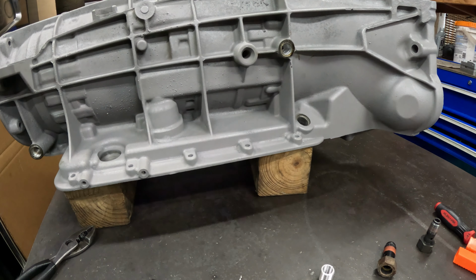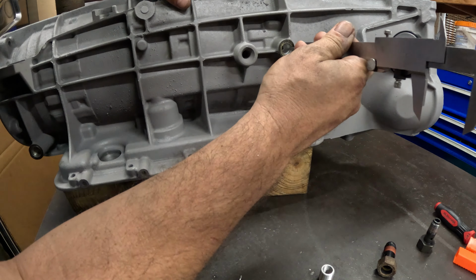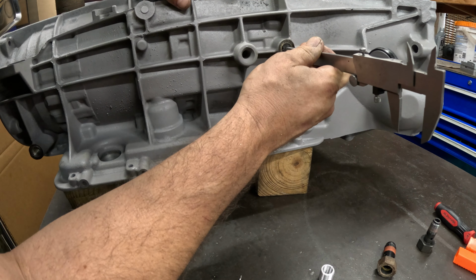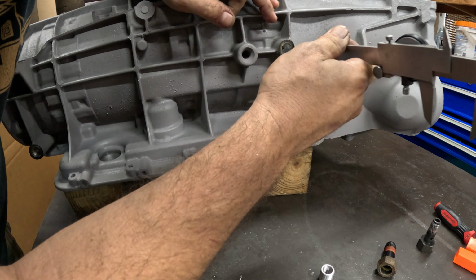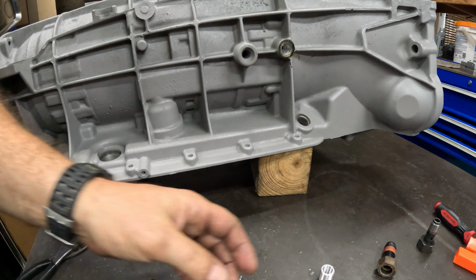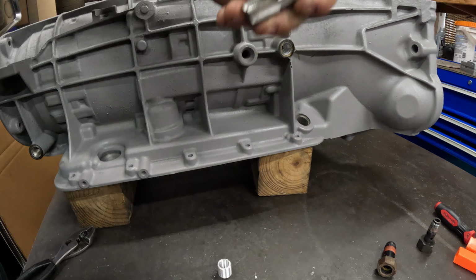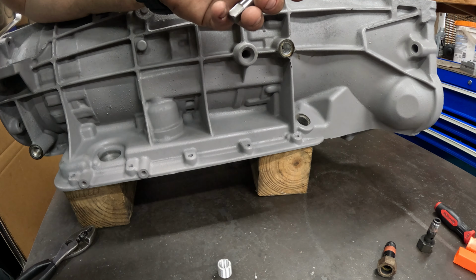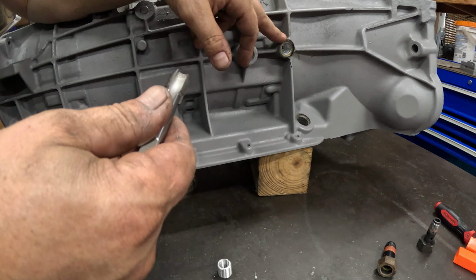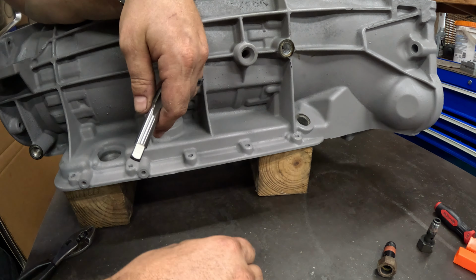All right, well, I got this drilled out as far as I can. And if I measure my total depth to where the chamfer from the drill bit starts in the back, I already know what it is. It's about 840 thousandths. Now I gotta remember, this is a plug tap, not a bottom tap. So I've got about 200 thou of depth where there won't be any threads. And I also need to recess this insert 100 thou for the O-ring that's gonna go in there,